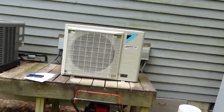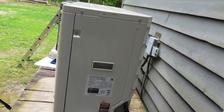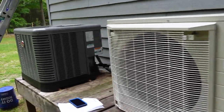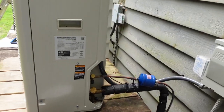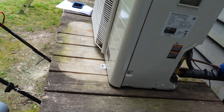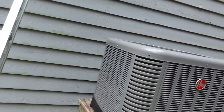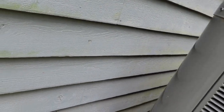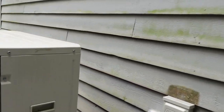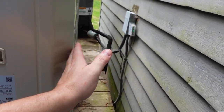Another thing I want to show you is how much smaller the Fit is. It's only a 14-inch wide cabinet, whereas this single-stage unit is 30 inches. I don't even think the camera does it justice — it's a significantly smaller footprint. You can even see where the old unit we replaced on this platform used to take up much more room. The Fit also does not require as much clearance. A lot of unitary-style systems require 12 to 18 inches of clearance behind the unit, whereas the Fit only requires four inches, meaning you can fit it in a lot of places.